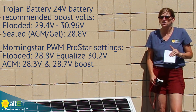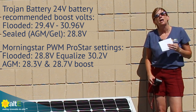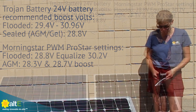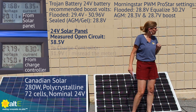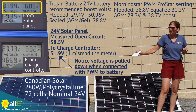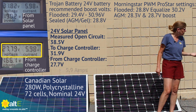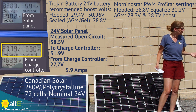Let's keep those numbers in mind as we go. I'm first going to plug in the 24 volt solar panel to the charge controller to the 24 volt battery bank and see what numbers we get. So now we've got our 24 volt solar panel plugged in, and if we take a look at our meters, we're getting 31.3 volts from the solar panel to the charge controller, and then out to the battery I'm seeing 27.7 volts, and about 5.9 amps. So this is really actively charging this battery.